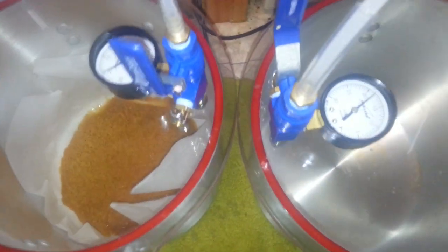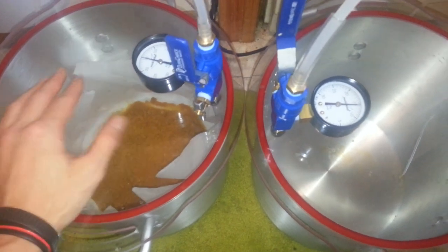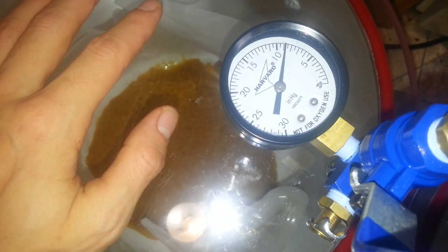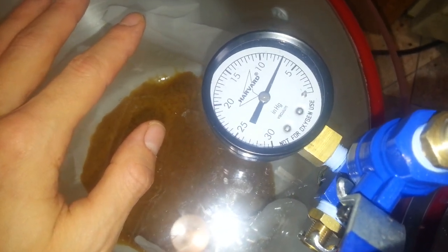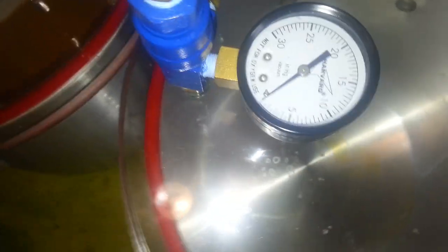Alright, so as you can see, they're pretty similar in terms of how fast they pull. What I would say from my experience is that the two-stage will pull a little bit harder. I've got it to peg out at probably negative 29.7, which is the highest I've ever seen. This single stage usually only goes to about negative 29, and maybe a little bit past it, but barely.